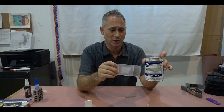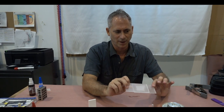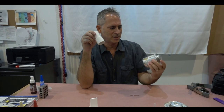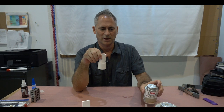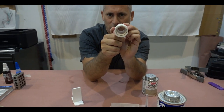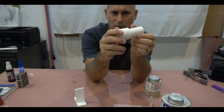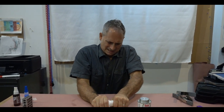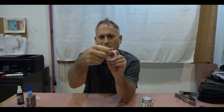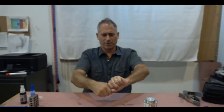Of course, solvents depend on having the right solvent for the right material. This one is perfect for acrylics. For ABS, acetone works very well. You'll have to look up the different solvents for your different materials and experiment. For PVC, the solvent is standard hardware store solvent found in the plumbing and electrical fitting area. This one wasn't a great mechanical grip since the pieces weren't perfectly conical, but let's test it — there is no way I'm ever going to split this. The PVC solvents are really amazing.